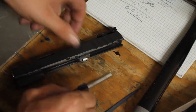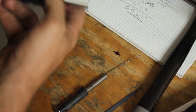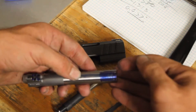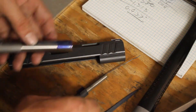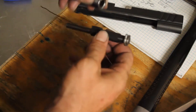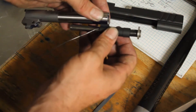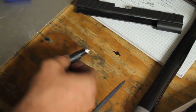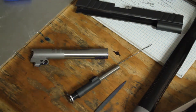All the sharpie is gone in the middle of the reverse plug — definitely this is the culprit. I can also see some wear marks on the barrel. To fit this, I'll take some 400-grit sandpaper, wrap it around the edge of the barrel, and rub it to keep the contour of the barrel into this part. I can see sharpie going all the way back indicating rubbing across the barrel all the way down. I'm using WD-40 as a cutting oil for the sandpaper so it doesn't load up. Will fit this off camera and be back when it's done.